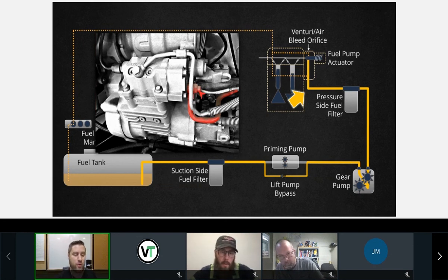The things that we were finding in these screens, most notably, are banjo fitting seal components. Okay, so we were replacing our banjo fitting seals on some of these components, and they're degrading because they're not compatible with diesel fuel, and then they end up inside of this filter here. Okay, so there's a screen inside of this fitting. You can't replace the screen, replace the entire fitting. If you guys do any service, I would recommend you get a new fitting with a screen, and make sure that that is brand new and fresh when you reinstall things. Okay, so not overly common, but there is a screen there. It's a last line of defense, but it's only 86 micron, and this guy here is 5 micron typically.